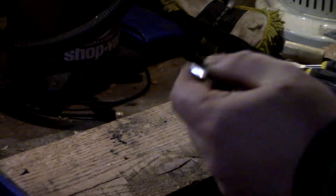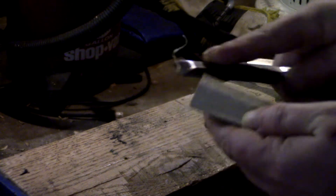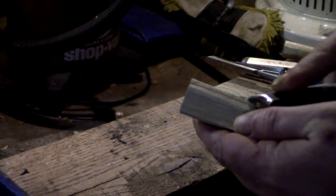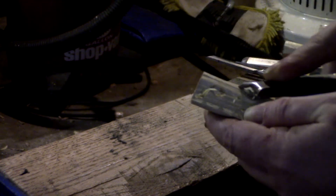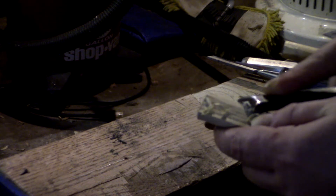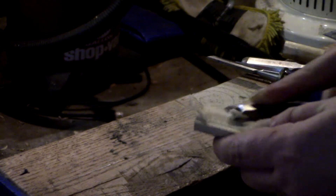I'm right where I need to be. Typically what I'll do is grab a piece of wood. Now you're going to be mindful of your tool — if you drop these on the floor you're going to chip the edge, so be very careful. I just want to know that it's cutting across the entire edge of the bevel. I should be able to get very controlled fine curls all the way across with no jagged edges, no tear-out. I should be able to use this like a fine carving knife and get my surface chiseled down to nearly a smooth planed edge.